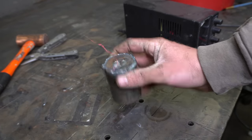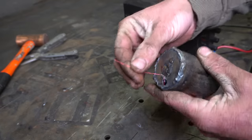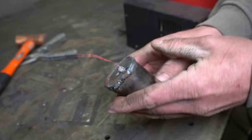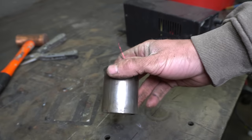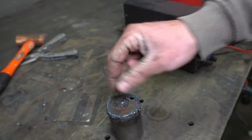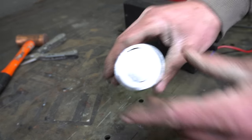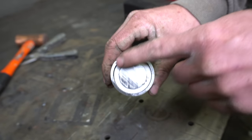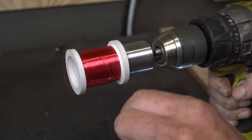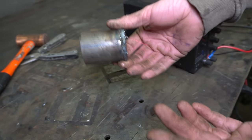It's pretty close. So this is the electromagnet I've landed on for a couple of reasons: one, it's decently strong — I kind of broke one of the wires off when testing, but it's pretty strong considering the size; two, we're limited by the current rating of the wire, so we can only add so many coils; and three, ease of manufacturing. To make this, I have a 3D printed spool that I wound the wire on and then pressed in here. That is a heck of a lot easier than any of the other things I was trying to do.